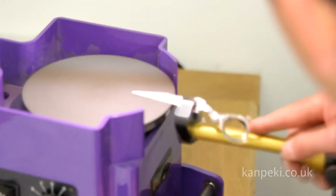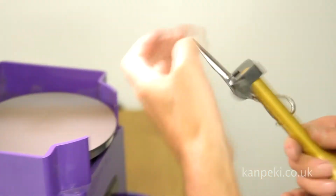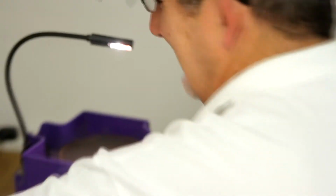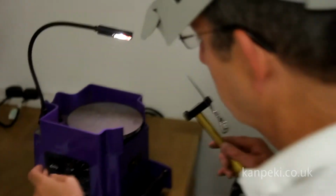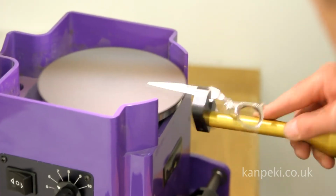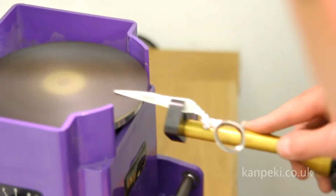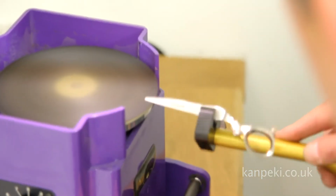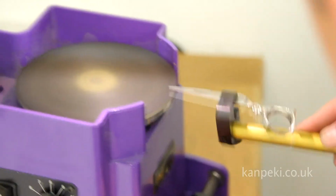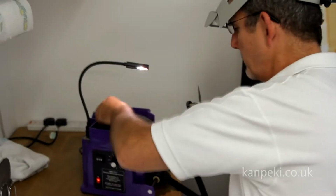So it's slightly less abrasive, and this will get rid of the scratches, if there were any, the very fine scratches that the first plate put in. And now we're down to a 9 micron plate. And then we finish off on a polishing plate, and this is impregnated with a diamond paste. Right, it's one half done. We start the process over again.